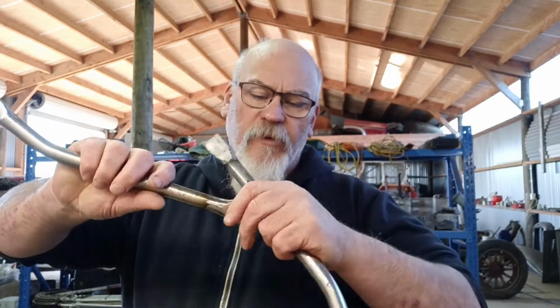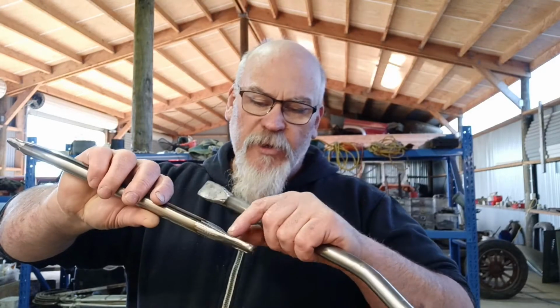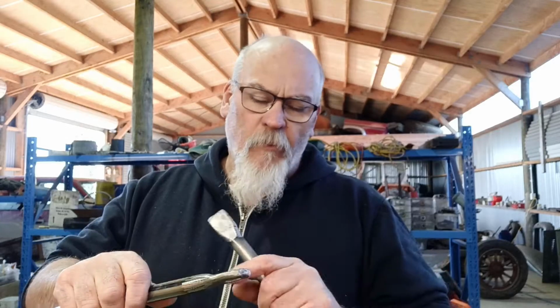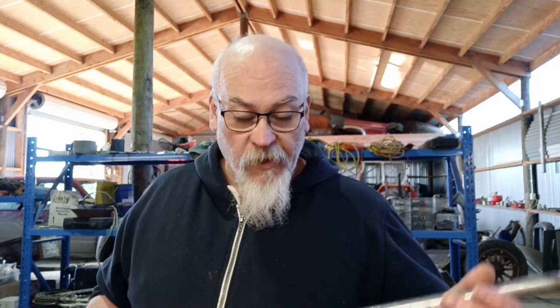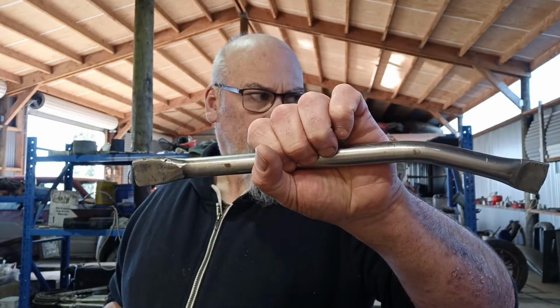So I've got to do some finishing touch-up welding, make sure there are no cracks or splits or anything in it, so it doesn't break off, because I've ground it down. But I've burned it in pretty hot, and I've mounted it back fairly well, into the wall of the tube. This is like 1.6 mil, basically exhaust tubing, but it's only 19 mil or 3/4 tube. But at least it actually looks like solid bar now.